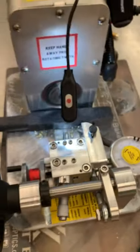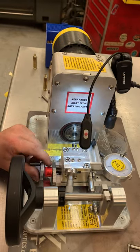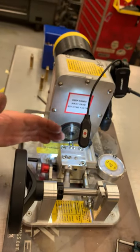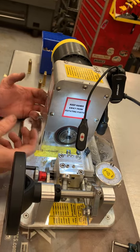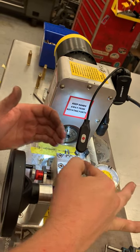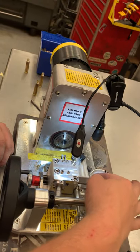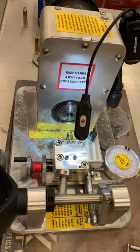That's the gist of how to set it up from scratch. These numbers on the red dial don't mean anything — ignore them. Only go by the indicator. Another thing to note: if you're running hundreds of pieces, the machine will have some inherent vibration from cutting. It's possible the slide can move over time. It won't change the thickness of your cut, but you may see more cut on the inside or outside than you want. Just make sure that stays within two or three tenths.